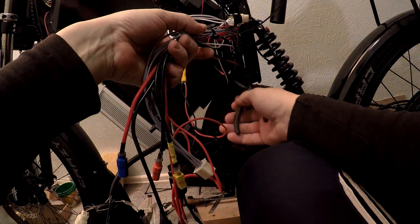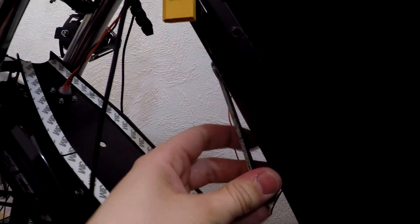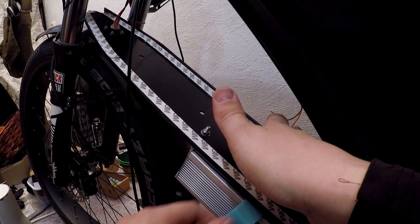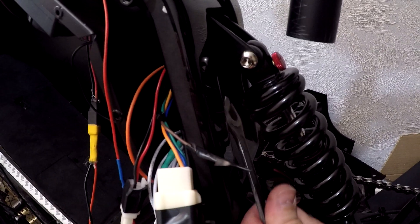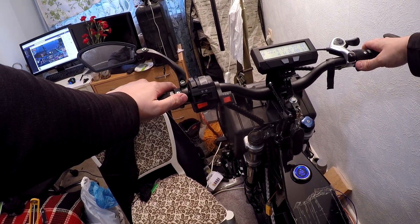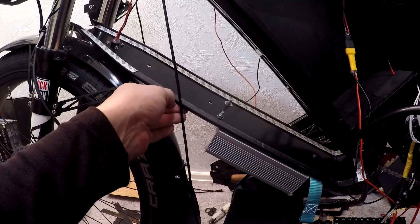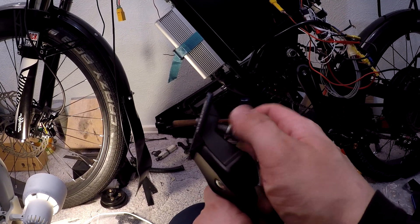You should be extremely careful when buying batteries. It's worth doing proper research either by Googling or searching forums. Batteries may sometimes be counterfeit — for example, a Panasonic battery may actually turn out to be a Chinese counterfeit with a Panasonic case and something else inside, or have a defective BMS that can lead to battery failure or even cause a fire.